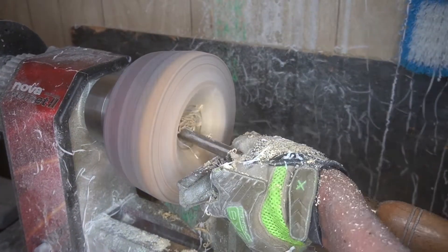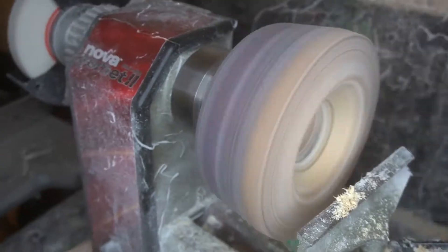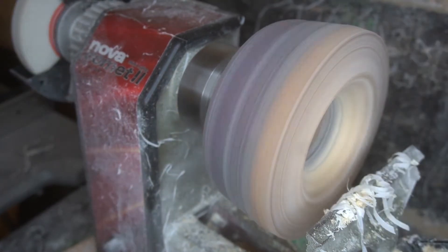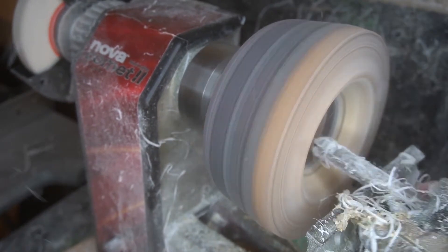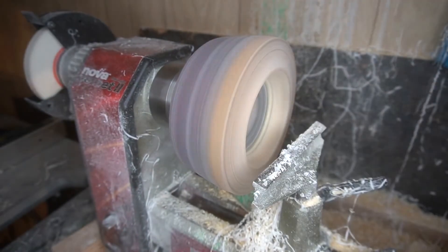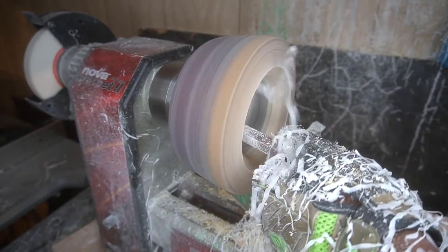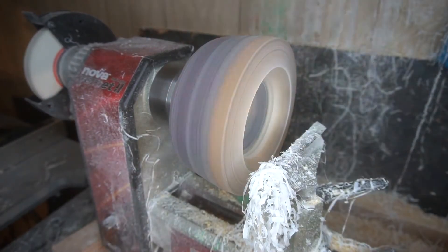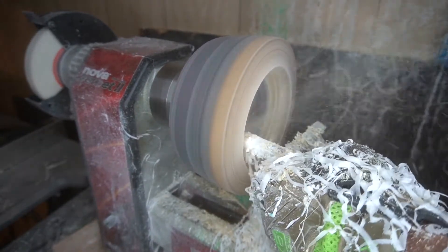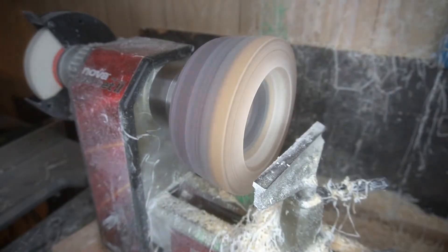You knew that I had that piece of pine on top and it didn't have a lot of problems. But once we got deep enough to where it was mostly epoxy, I started having some issues with the bowl gouge itself — a lot of chatter, a lot of resistance on the lathe. Round carbide tools in my opinion are just better when you're having those kinds of issues. So I switched a lot between the round and the bowl gouge, using the actual gouge itself for a lot more of the pine and wood portions of it.